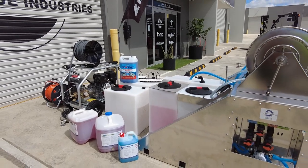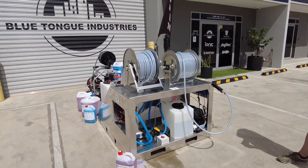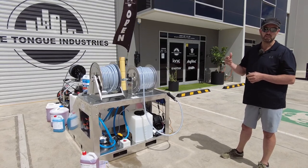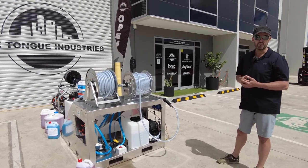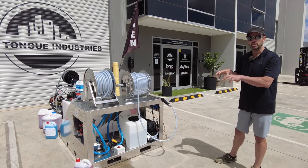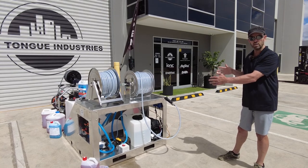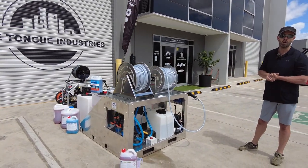The piece of soft wash equipment today is on our large purpose-built skid, powered by a Delavan 12 volt pump at just over 26 litres a minute at 100 psi. Pump configurations come in multiple choices: 12 volt from the Delavan or the Everflow, 24 volt from the Everflow, or the Honda P40 configuration. The skids are designed to take multiple pumps with laser-cut holes to swap and change between pump selections, including the Honda P40.